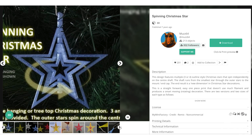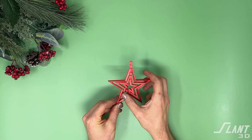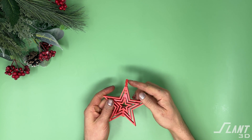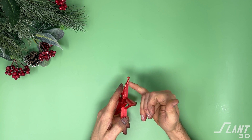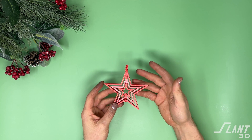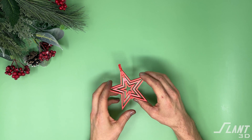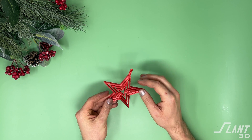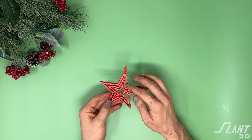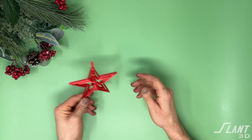The star is actually a really cool shape because it's impossible to manufacture any other way. 3D printing lets you make mechanisms that were never possible before, all in one shot with no assembly — it comes off the machine and is done. The issue is that since the first layer is so complex and has to be separated, you end up with potential defects where it just didn't stick to the bed and ends up kind of ruining itself because it shifts or moves. When you're making tens of thousands of these, you don't want this to occur. A good way to fix this is to have a sprue running across the core — a single spine that might be cut, snipped, or broken loose when spun, so the customer just breaks loose these areas and they spin free. That makes sure these aren't individual little islands that have to be printed. But the shape and style can really be made affordably with mass production 3D printing and looks great on the tree.